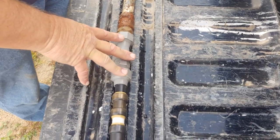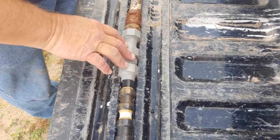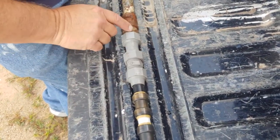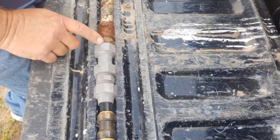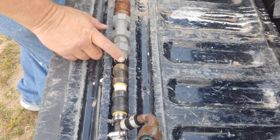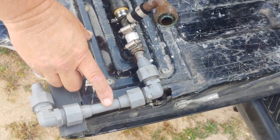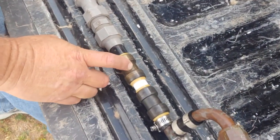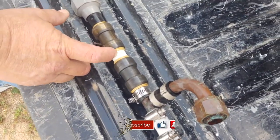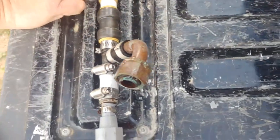Here, this would be something from the 90s, early 2000s I would guess. This is Quest gray pipe fittings. They connected to — I think this is a brass fitting here — to get a thread that they wanted. And then they went to a black pipe, which is an alternate to the Quest pipe, which is right here. And then they had gator bite or shark bite. And then they went to a white PEX material and then another gator bite. And then they had black pipe again, like this right here.